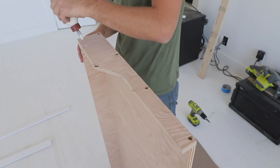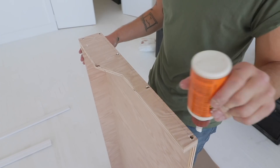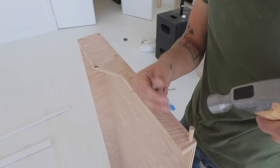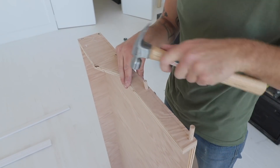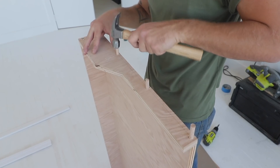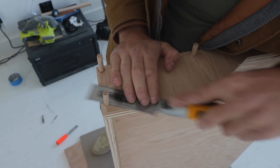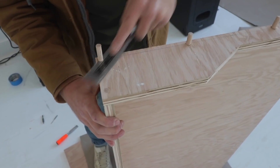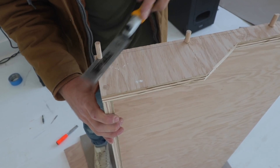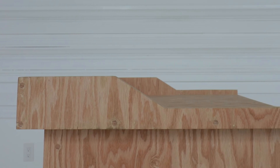This whole step really is simple, and the only tip I have is to make sure the grain orientation of your dowels either matches or is directly perpendicular to the grain of the wood. This just makes everything look a little more intentional and like proper joinery, even though we both know this is a hack. And with that, the top for the desk was complete.